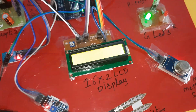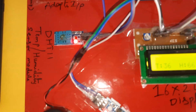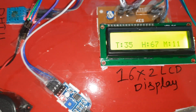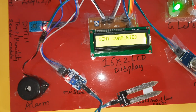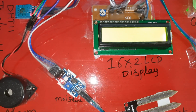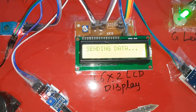Now I am giving humidity input to demonstrate the humidity alert. Humidity rises above 70 — currently showing 70 on the display. The system continuously sends data to the server. Humidity reaches 76 and then 74, and since it is above 70, the alarm triggers for over-humidity, sending the data to server successfully.